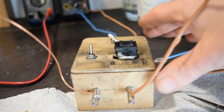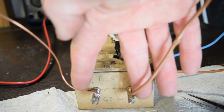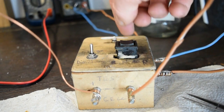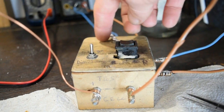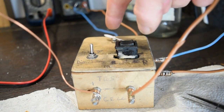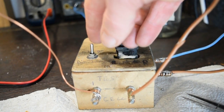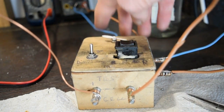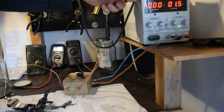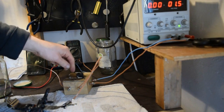To help with testing I built this little box. We get the electricity supply through here, we put the cell on these two connectors. We've got a little electric motor from a very small drone I didn't want anymore. There's a switch which flicks between either the motor load or a 270 ohm resistance if you want to measure capacitance, and a switch for charge and discharge. A couple of leads go to the voltmeter. So we've got the power supply at 1.5 to 1.6 volts, and here you'll see the current draw.